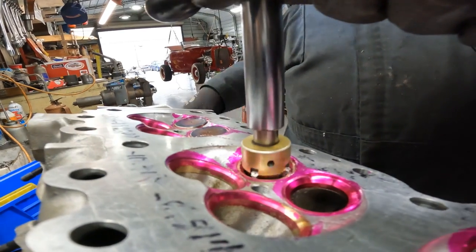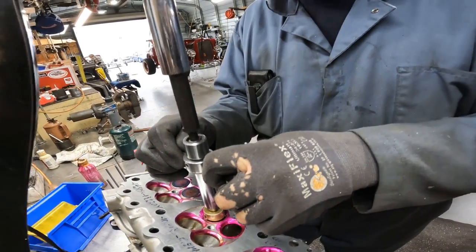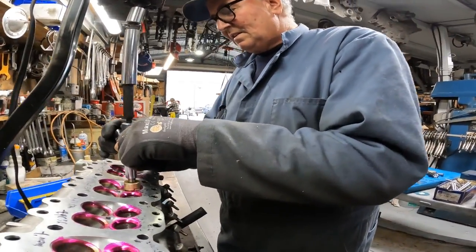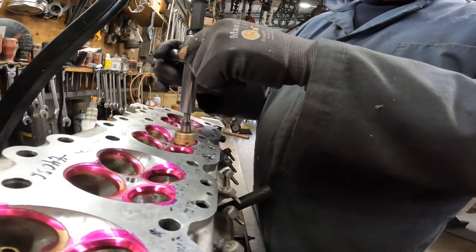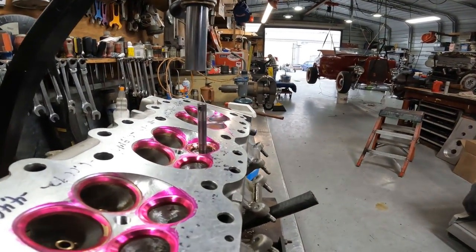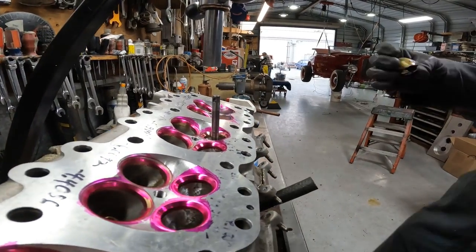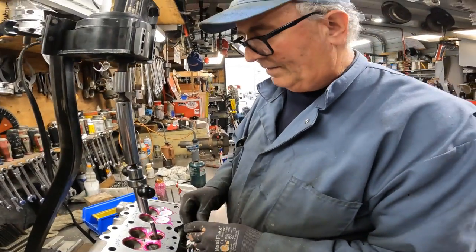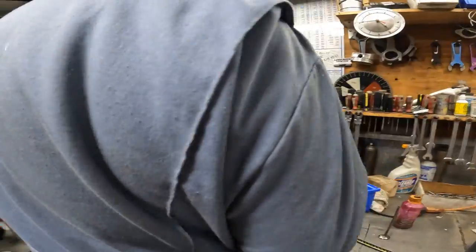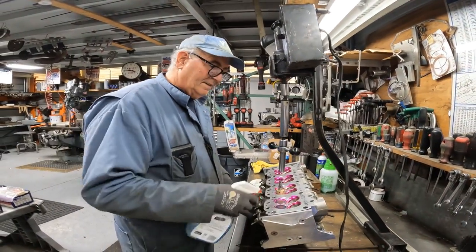I do a throating cut too. So what angle is this one that's cutting? This is a 30. And your final is a 45? The angle is 45. So is there a 60 also? Well, this is a 60 and the top is 30. The seat angle is 45. And then I have a 75 that I do kind of in the field — just to open up underneath the seat.